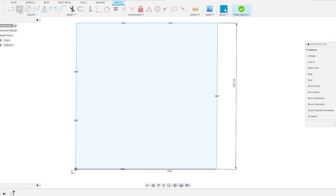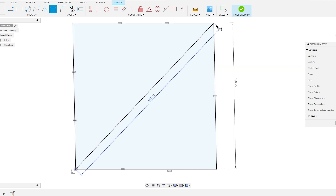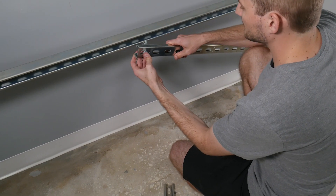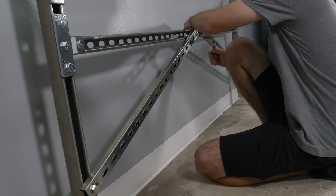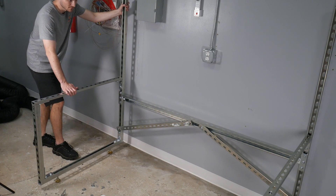The easiest way to address racking is to add a shape into your structure that can't turn into a parallelogram, the simplest being a triangle. So by simply adding a single support across, turning it into a triangle, no matter what you do, it can't change shape. So that's exactly what we did with this back support, except instead of just making a single triangle, we used two smaller pieces of strut and made two triangles. And you can see when I go to push in that direction now, there's very little wiggle.